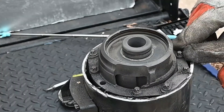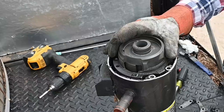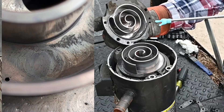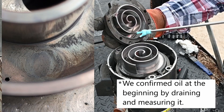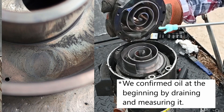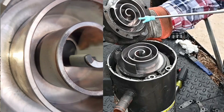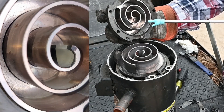Now we're going to take all of these little bolts off — these are star fittings. This is called the fixed scroll. This is the side of the scroll that doesn't necessarily move, but it can go up and down a little bit, which we call axial compliance. As we look in the bottom of this fixed scroll set we see these deep circles — those are called galling. That means at one time it ran either without oil or with compressor overheat. We also look for any type of cracks or wear in the actual scroll itself, and there are none. The scroll set itself looks really good. The oil makes that seal and the Copeland scroll doesn't wear out — it actually wears in.